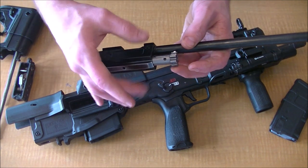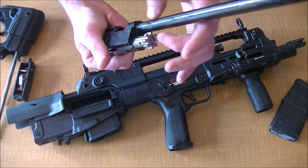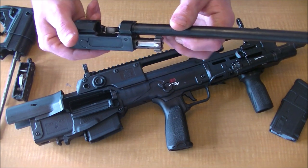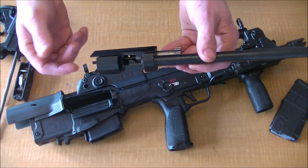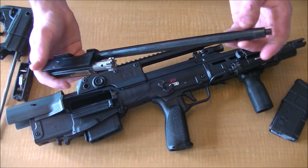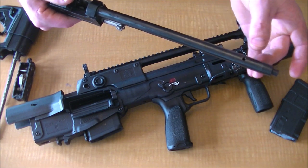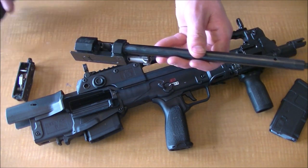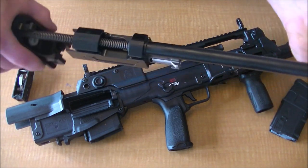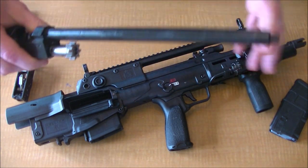The bolt is very G36-esque as far as the bolt head is concerned — being stainless and having seven lugs, plus one on the actual extractor. It's very much overbuilt for that, and that is just fine. I like the way it's able to be reversed very easily, though I'm not really into swapping over to left-hand usage. I think it changes shoulders just fine and prevents brass from going in the face. It's a nice sturdy bolt, but everything's pretty much contained. This is really just kind of an empty rod where your recoil spring goes in, so instead of having an empty space like the G36, it actually has a little captive area where the recoil spring rides and is protected instead of having a reciprocating effect.